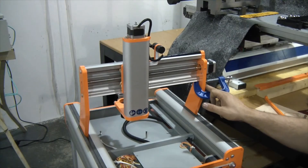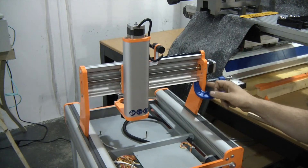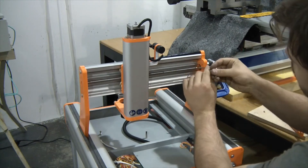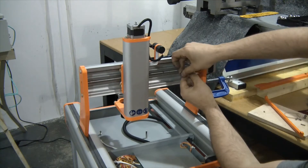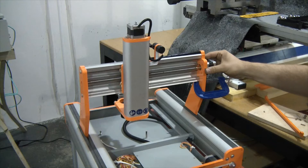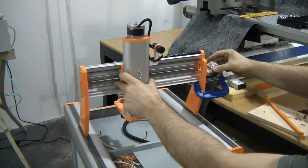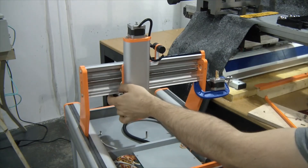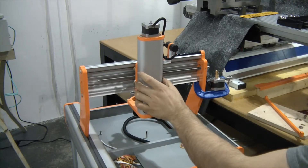I've supported the cable on the motor side of the x-axis with a G-clamp. I'm going to make sure that grub screw is slackened, then remove the last M3 bolt holding the motor in. I can slide off the x-axis motor and let it rest on the G-clamp, then move the x-axis across, remove the bearing, and now I have the x-axis free.